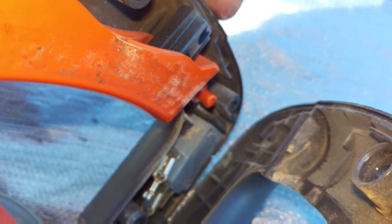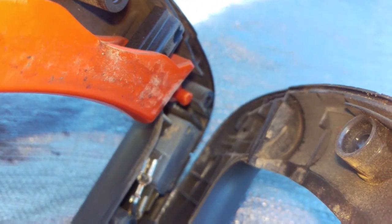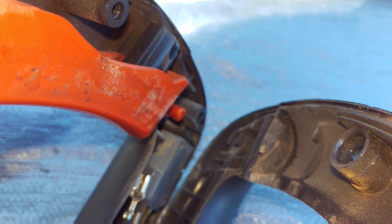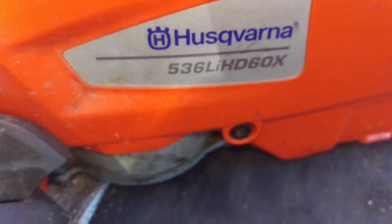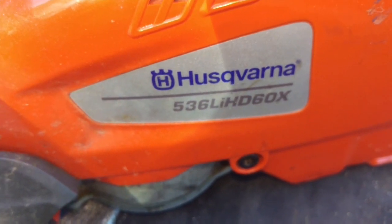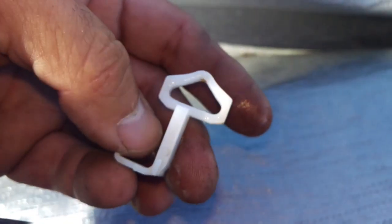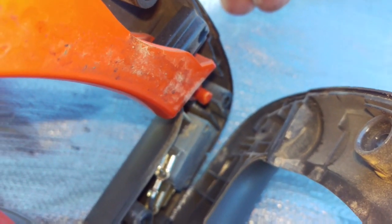That little peg has to overcome the resistance, and that's what strains and breaks that link. I tried to write an email to Husqvarna but my mail got kicked back because I had a link to the video. I also went to where they're promoting the 536 LiHD 60X lithium model. It's just a design flaw - maybe if this piece was rounded it wouldn't fail, but as it is it's destined to fail over time. Maybe that's what they plan on.